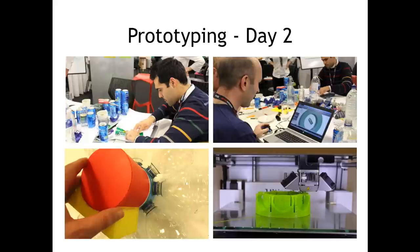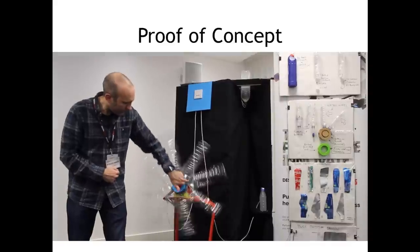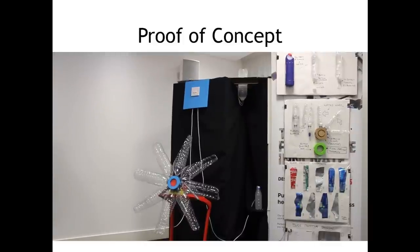On the second day we moved into having our first attempt at working with soda cans and folding the aluminium. We're probably nowhere near as skilled as the people who've been doing this for some time, but we wanted to prove the concept. We're also working up the scheme in CAD using DesignSpark Mechanical software, which allowed us to 3D print something. Naturally you wouldn't 3D print this in the long term — you'd probably need something injection moulded to get the cost down. Either way, this is the proof of concept, and as you can see, Richard is mounting what would be a water wheel — the torque is pretty low, given that he's able to push it round with his finger. You can see it's switching on the roof light, and also a desk light if you prefer. This could be switched out to work with wind power as well.